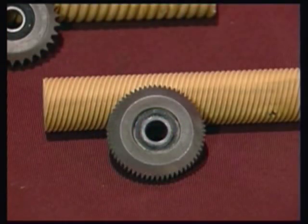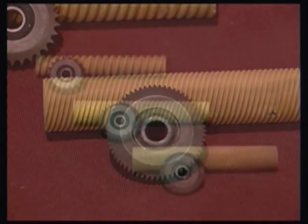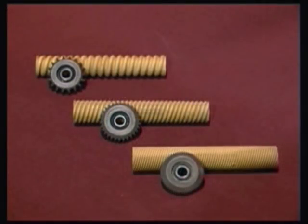In use, the principle is the same for all the wheels, but the 2 mm wheel removes far less material and so is faster to use. The spiral it produces is quite fine and delicate, so a fine-grained hardwood would be best. Please note that not all timber will be able to support a spiral this fine, so the general rule of thumb is that as the wood becomes softer, so the size of cutter wheel being used needs to increase.